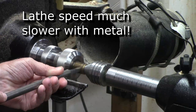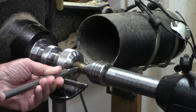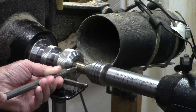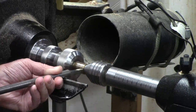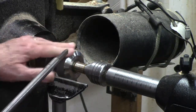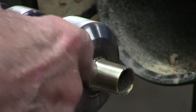With just light cuts I can cut this brass without any problem. I cut most of those threads down and I'll continue a little more. I sanded it at 240, 320, and 400 grit, then put a little micro-fine honing compound on it and polished it with 500 grit — it just shines up like a new penny. I rounded over the front a little bit and now I'm ready to part off a piece.